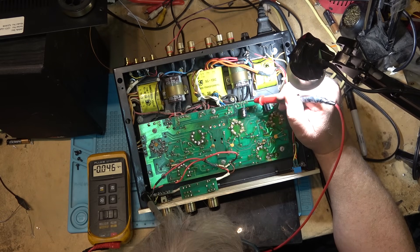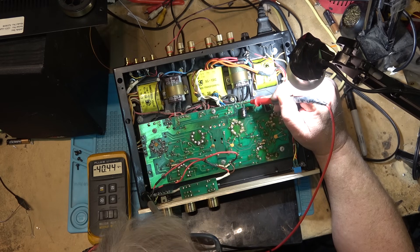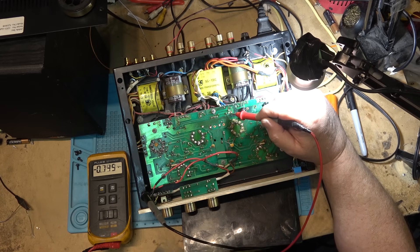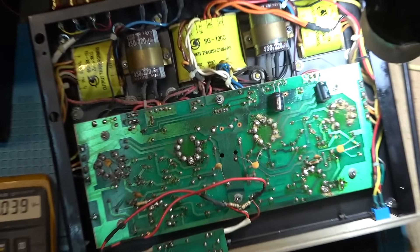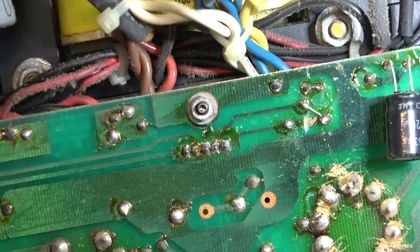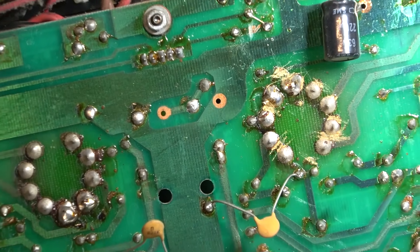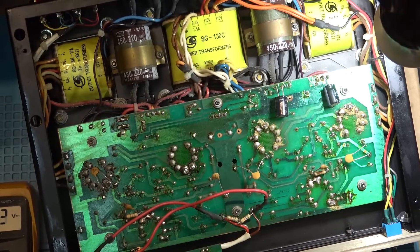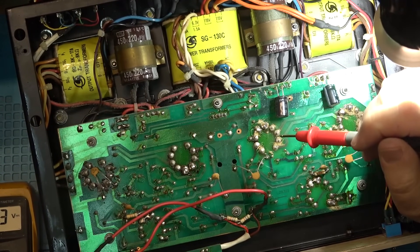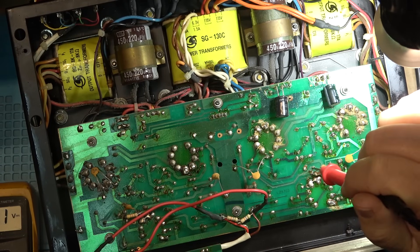Notice I'm working with just one hand — the other hand is safely away from anything conductive, and that's a must when you're working on tubes. Looks like somebody's done modifications on this — you can see where the board has been cut. Someone's cut that trace and put a jumper across it. This thing's been hacked. But essentially you've got two mono-block amplifiers: a right channel here and the left channel — this is the side that's got the noise on it.